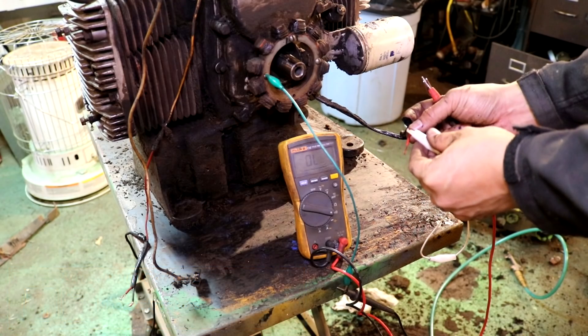Let's pause it right there. The tones that you just heard out of my multimeter was the tones of continuity. If you look at the screen, that little green jumper cable is attached from one of the leads of my multimeter to the stator laminations, which represents ground. The other alligator clip - the white one - I am touching the actual stator windings to. Now, if this stator were good, this continuity tester would not beep at all. The fact that it's beeping shows that there is a connection between the stator windings and ground - that is known as shorted to ground. And that's why this charging system did not work when I got the tractor.